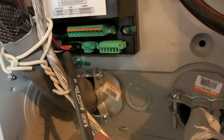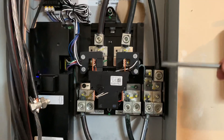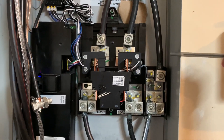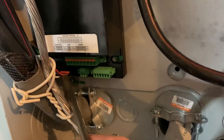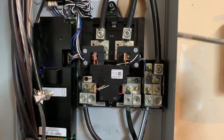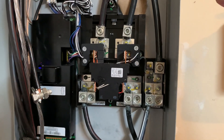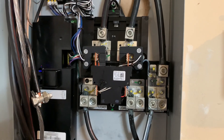Down here there are four 12-volt communication lines. As your gateway detects — say somebody just started the microwave and is using a kilowatt of power — it will communicate to the Powerwall through these wires, telling it to go ahead and release one kilowatt of power. That will zero it out, and you won't be pulling any power from your electrical provider any longer.